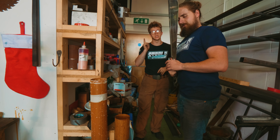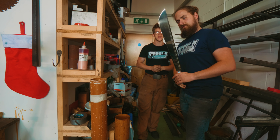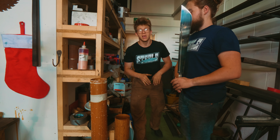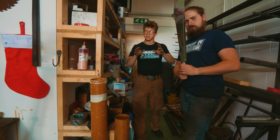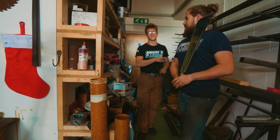If not, we make a beautiful 600 grit finish. This is the moment of truth — attempt number one at showing the etch using the ferric chloride acid, just the same way we etch with Damascus, except a lot less. Here we're not trying to create highs and lows, we're just trying to create a difference in contrast. This is test one at 3,500 grit.